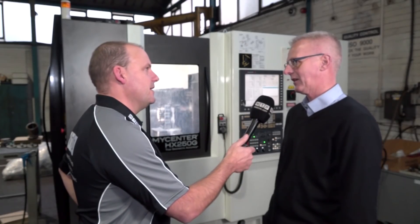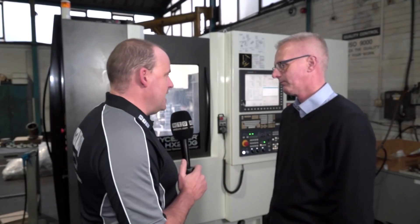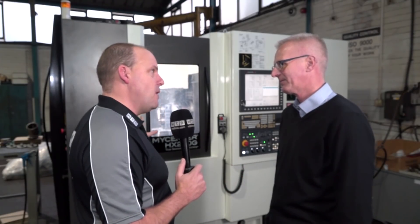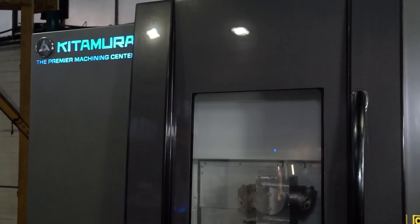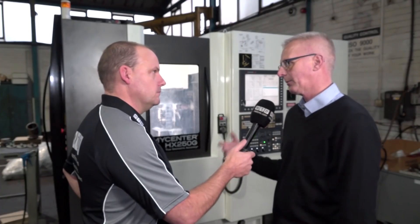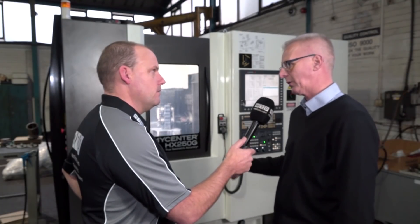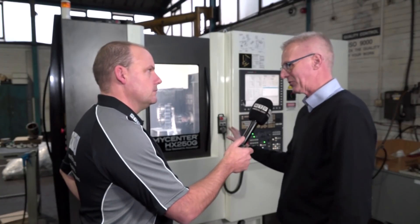It went in very quickly after seeing it. It's been in for a little while now and it's actually cutting in anger here. Some people might look at a Kitamura and say it's a smaller machine — nimble for high-speed aluminiums — but this is proof that's not just the case. This is cutting cast iron now. What we learned with the mill-tap type machines and the BT30 spindle is that we're confident that spindle size can do this machining.